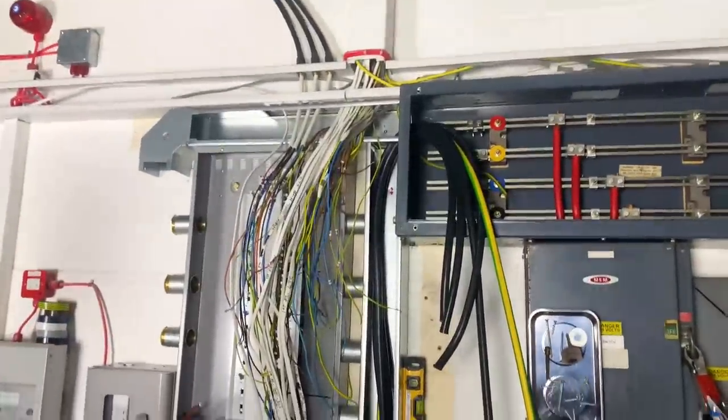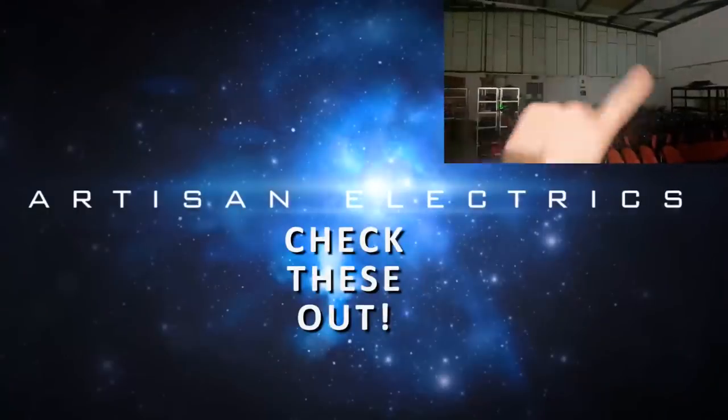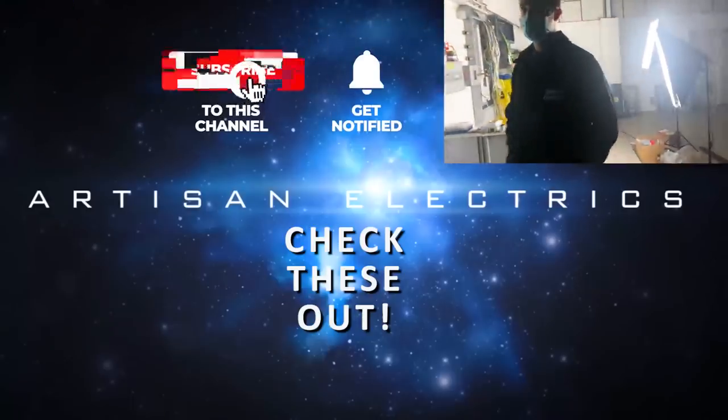Yep. So tomorrow, 2 5-core 6mm armoureds going in for some Zappies over there somewhere in the dark. This cable tray is nearly finished. Over here it's just this little tricky corner that we've got to do like a funny little set to the side on. That didn't quite get done. And then just get the cable in for the sockets over there. So that's a little bit to do tomorrow, and then all good.